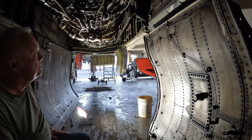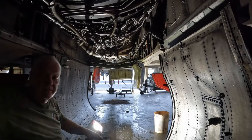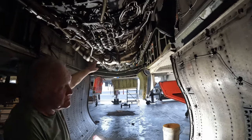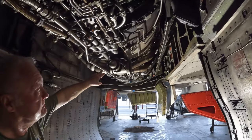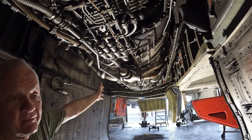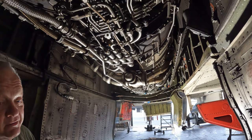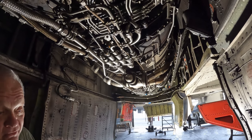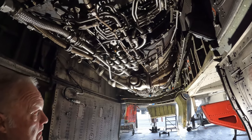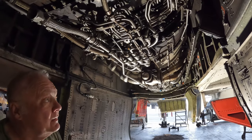It's fire and overheat — the overheat part is actually back here with the nozzle. These bleed air ducts are known to blow every now and then — they'll just blow a chunk out, and it's very hot air coming off the 17th stage. It'll get so hot it'll set off the fire indicator, so you're not sure if you've actually got a fire or just a blown duct. That would be an in-flight shutdown and hope-for-the-best situation, or bring it back to idle.